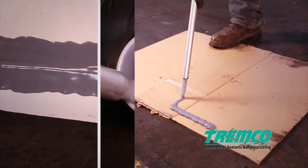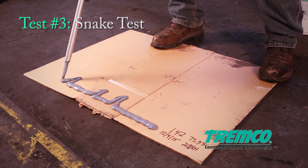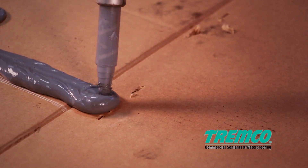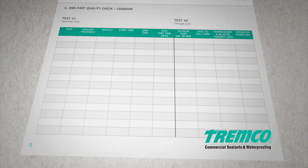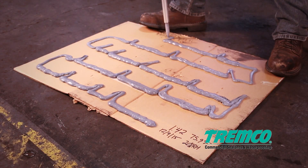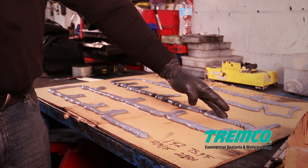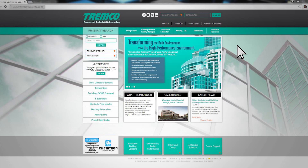Test 3: Snake test. Allow the sealant to cure for 24 hours. Check Shore A at each of the meter change locations and pump directional changes and record in the logbook. Variations can occur, so record softer Shore A readings at each of these changeover locations. Uniform Shore A is less than five points from norm at soft spot locations. The goal is uniform Shore A after 72 hours.